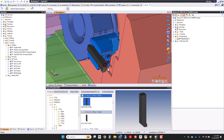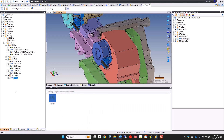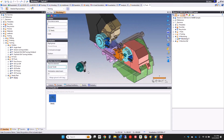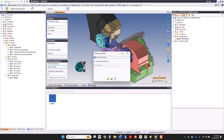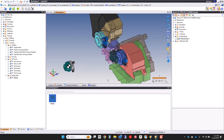Now maybe we also want to include our steady rest. No problem — I can go here and activate the search for my steady rests. This machine has a very specific steady rest that goes into it, so I'm going to drag and drop that in and pop it right into position. Green check. It's just really, really fast to tool up for whatever part you're programming.